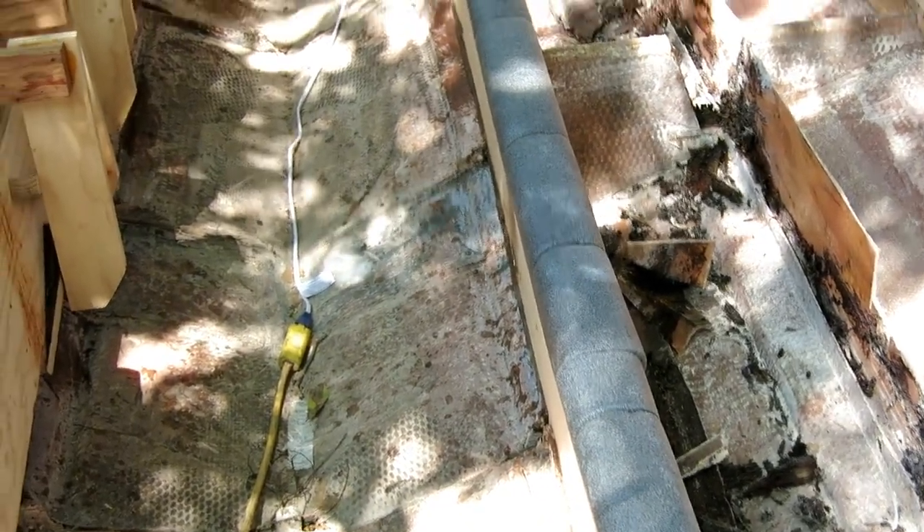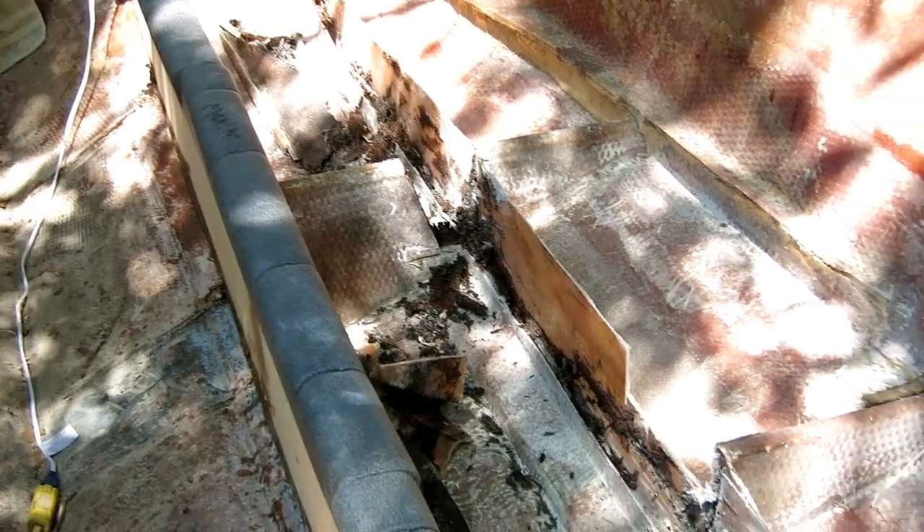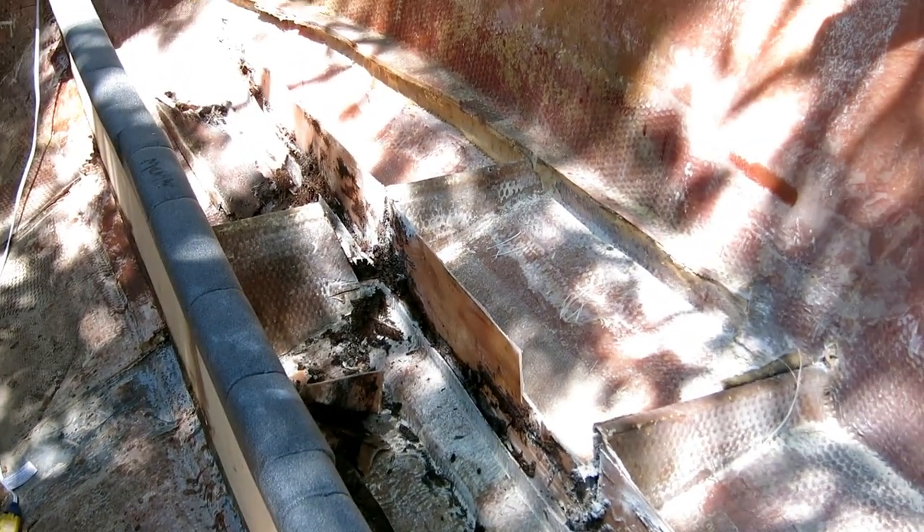Twenty minutes - that's all it took. I'm getting better at this. I've got the glass cut out, so all I need to do is dig out the muck, sand the inside surface of the existing glass, and I'm basically ready to fit and glue in new Divinycell stringer core. My clamps are tied up right now but I should be able to get one glued maybe this afternoon.